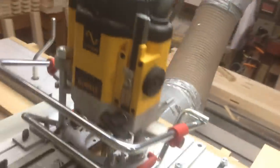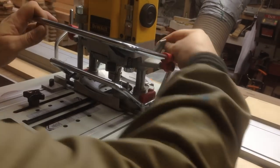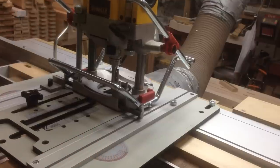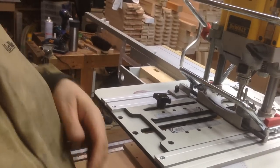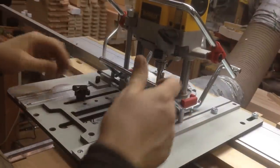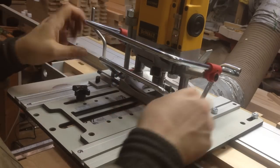Then you just continue — go deeper and deeper. Once again, you release this, push this up, and pull the stopper out from underneath. Then again, I want to be in between the two points. I look and see that's my third position, which is the most extreme outside one. For that one, I have to release this and move the bar, then this has to go all the way to the third position. It lines up with the mark, and I go back and forth and plunge until it's done. I come up, pull the stop out.